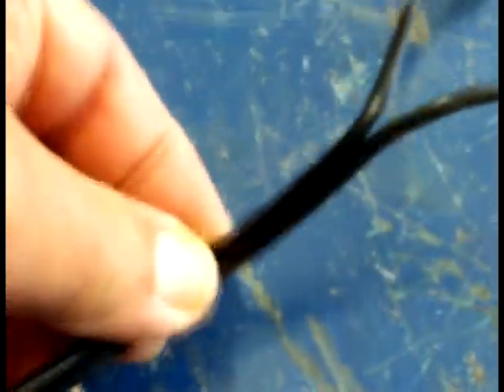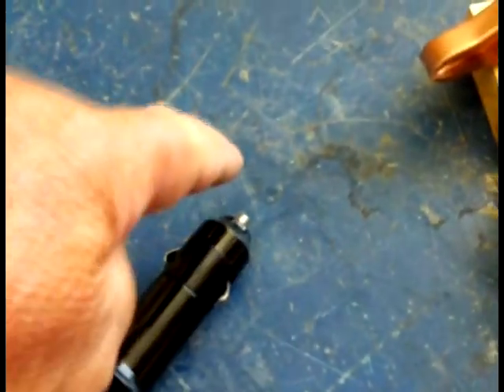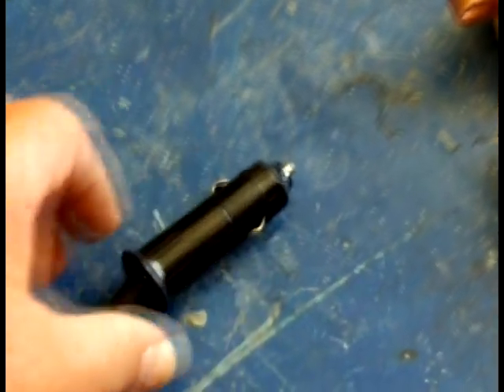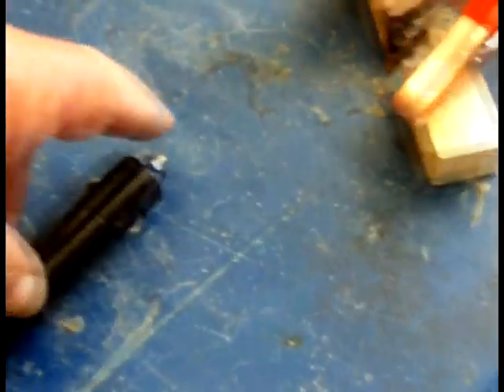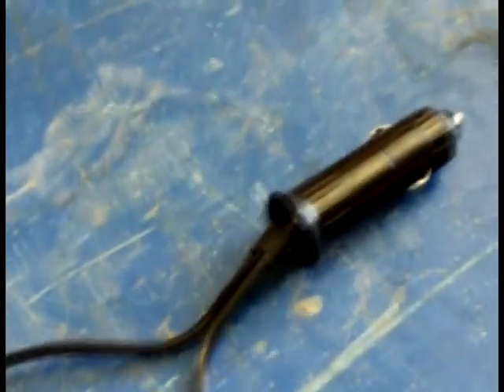I'm going to show you what we're going to do with this. I've already split the wires — they're molded together and I'm going to split them. Now what you've got to do is determine which is the ground and which is the hot. Almost always the center is the hot and the side is the ground — the hot being the positive, the ground being the negative side. These wires don't have any color code to determine which is which, so we're going to have to use the voltmeter to cut into this and see which side it goes to.